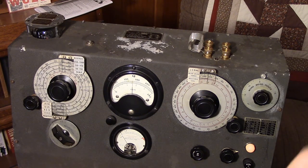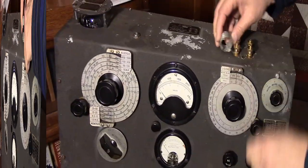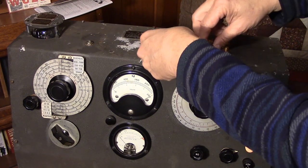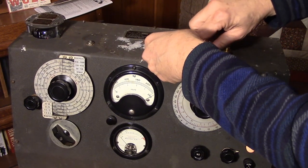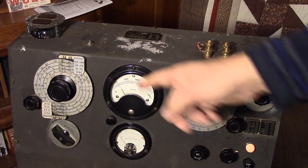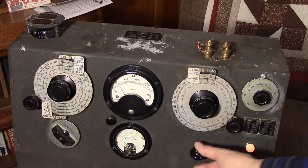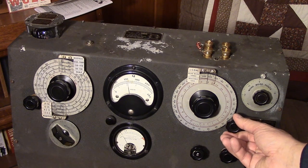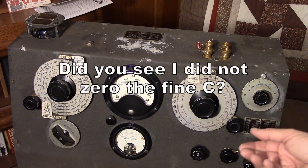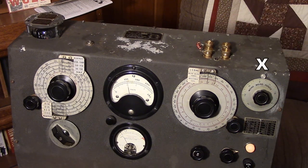We can put the toroid on there, turn the drive down, and put the toroid in — which was very close, by the way. We remembered that by coincidence the air inductor and the toroid were both very similar in inductance. It's reading a little bit. Bring this up. They're not giving us the same Q that the air coil is, but just a little below 1.8 microhenrys on this toroid.